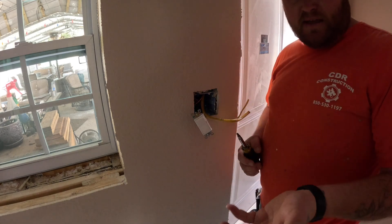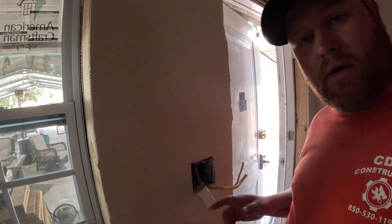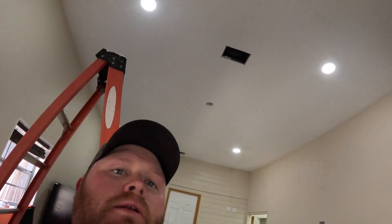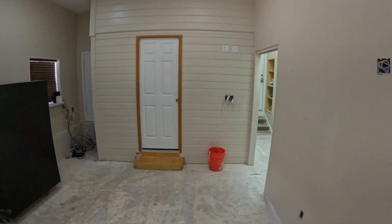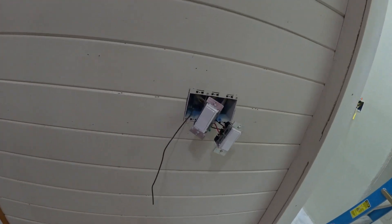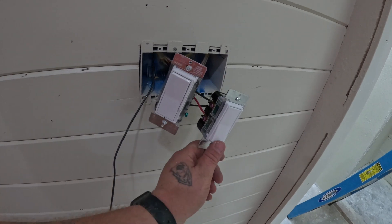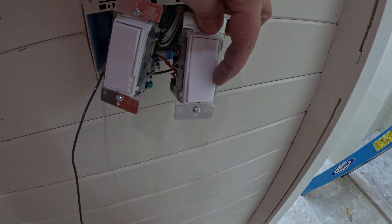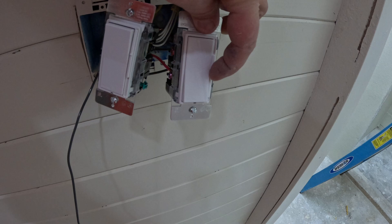Now all we have to do is test it and set our switches. We just turned the breaker back on — we want to check our switch. Our lights come on. We can see our four lights, and we come to our dimmable three-way here. We'll turn it — it turns off, turn it back on, and we'll check our dimmer. So there you go, folks — that is how you wire up a three-way switch. Thanks for watching. If you enjoyed the video, give me a like and subscribe so you can stay up to date with everything else we're doing. Till next time, keep making dust.